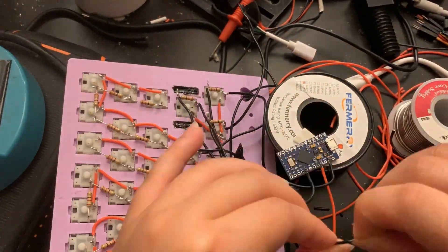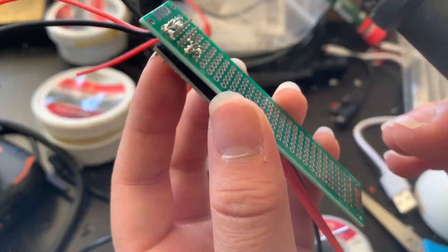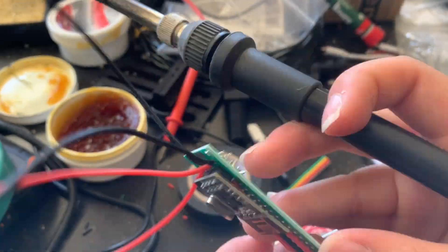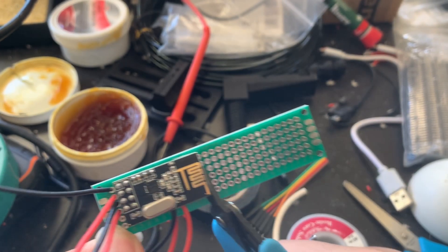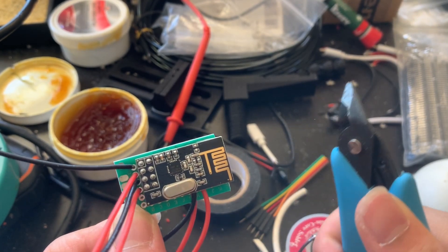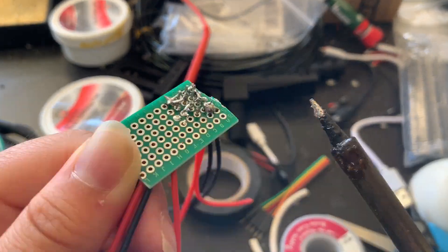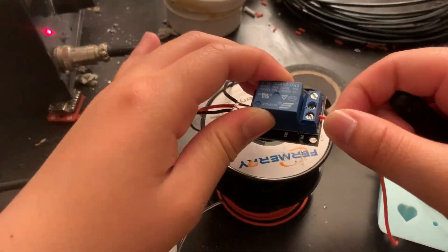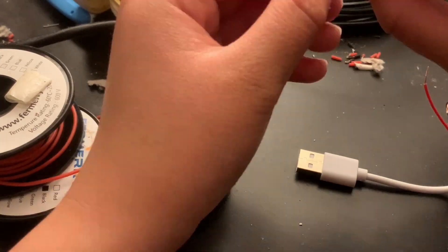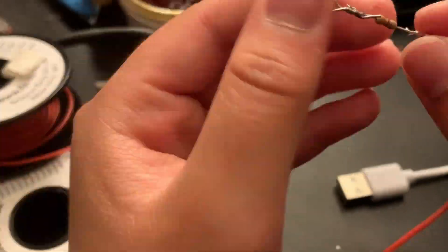Once all the keys were in place, the wires were carefully soldered onto the Arduino Micro. Here I am soldering a radio module to a PCB to make it easier to connect wires to it, but the PCB also made the module too big to fit in the casing, so I had to cut it afterwards and trim the extra wire bits. Now I'm connecting the relay module, whose purpose is to control the power to the mouse's motherboard. It also requires a voltage divider created with resistors, because the mouse uses less voltage than the Arduino.